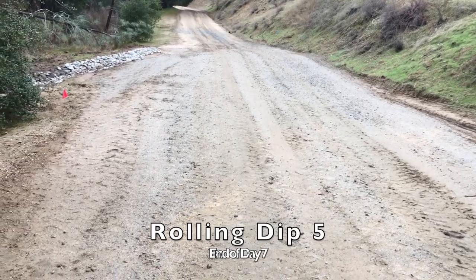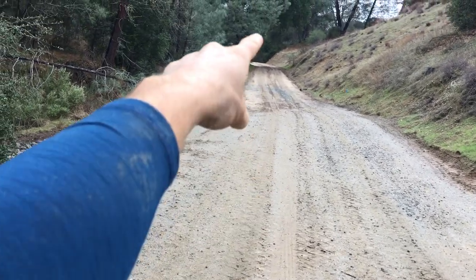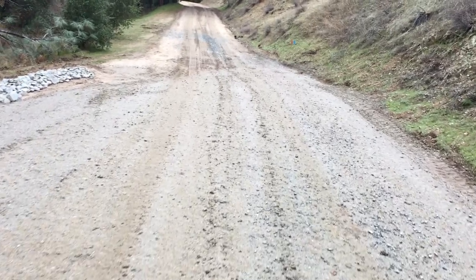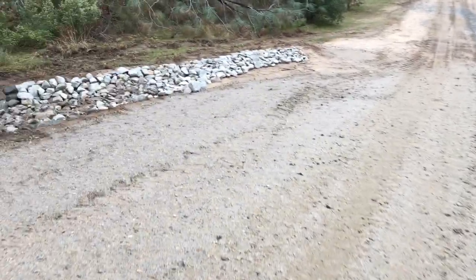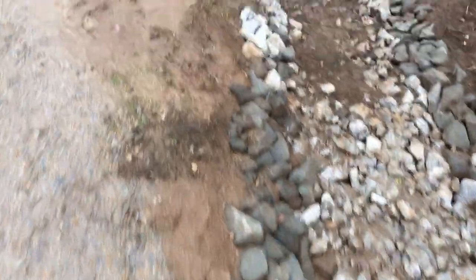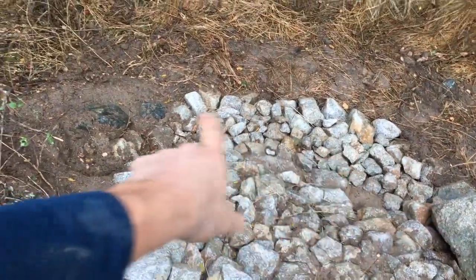Here we are at the end of Day 7, finishing early. This is Rolling Dip 5 — where we started the first video in this series. Water comes down and crosses the roadway at this low point with a nice rolling, rocking-boat motion for trucks and trailers, a very gentle roll-out. Then it goes right into the longest rundown with a big sill that's going to self-level. We have armored riprap all the way down into the drainage bottom, and at the bottom we have the tips-up medialuna shape to spill the water as broad as possible over this edge and passively let it go right where it was going before.